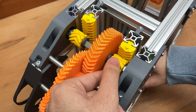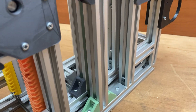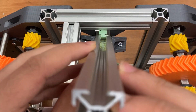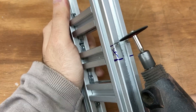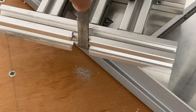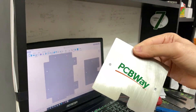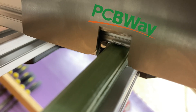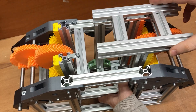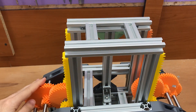I placed the racks using the slots in the extrusion, so the distance between rack and pinion can be adjusted easily. I also added a slide at the back so the press head moves more smoothly — it slides freely. However, because of this slide the press surface didn't fit its place, so I cut that part off. Next I mounted the second stainless steel piece, also 1.5mm thick from PCBWay, covering the top press surface. The press is now almost done.